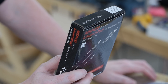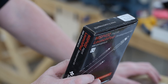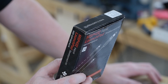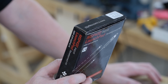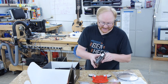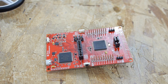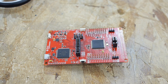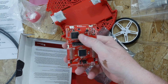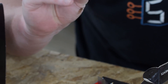256K Flash, 14-bit ADC — that's pretty cool. Comparators, serial communication, and more. High performance with up to 48 MHz CPU and a floating point unit — that's pretty cool for a microcontroller. And of course it's optimized for low power, like all the MSP430 lines. I wonder if this has wireless on it. I'm not seeing any. We've looked at modules in the past from TI that are wireless, but this looks like a pretty standard MSP430 development board. You've got your MSP432 on this side, and the other side acts as your programmer debugger. And if you wanted, you could break these in half and then have a dedicated unit.